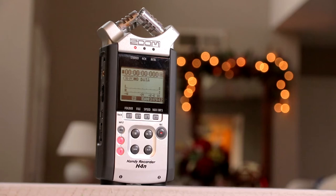There's a similar situation with my double system audio. This is the recorder I use for doing double system audio when I want to have much cleaner audio than I get sending it directly into the camera. This is a Zoom H4n, a very popular audio recorder with independent filmmakers. It records really high quality audio, but it does have one drawback: the internal amplifiers are not great. When you turn them up to get enough gain to get a quality signal, they introduce quite a bit of noise or hiss into the signal.